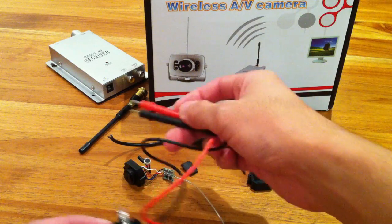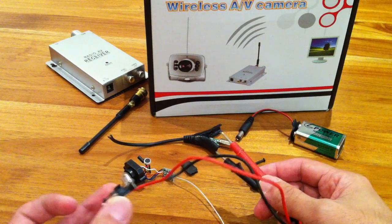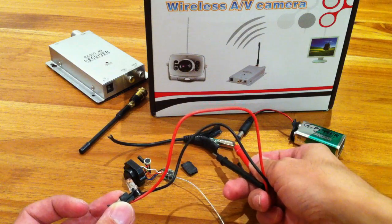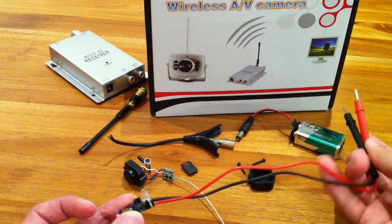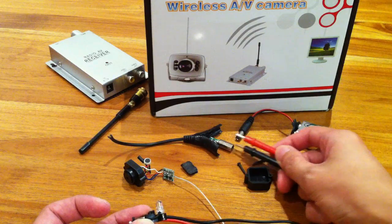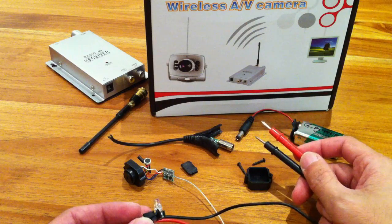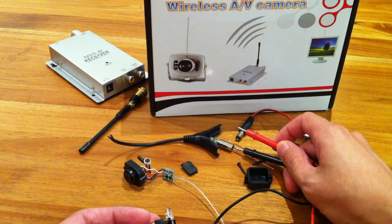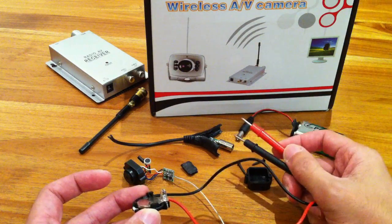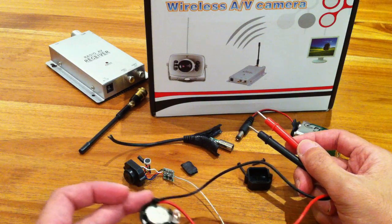I tried all different combinations and I found out that the LED light lit up brightly — 100% continuity in the circuit — when I have the ground to the black, and also lit up completely when I have the positive signal to the yellow. Now what's interesting is when I have the positive signal to the red, which I thought would give me 100% continuity, the LED light did not light up fully. In fact, it was quite dim.